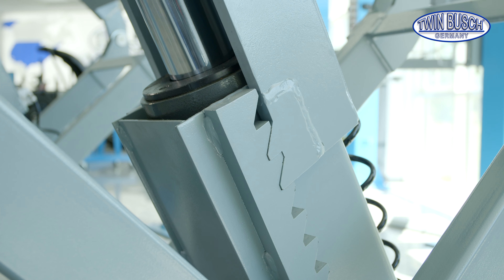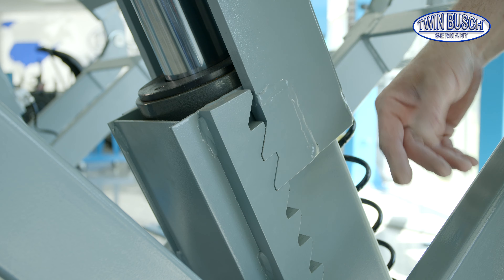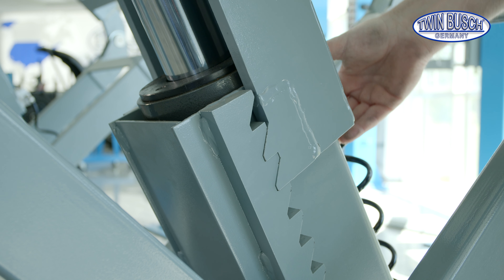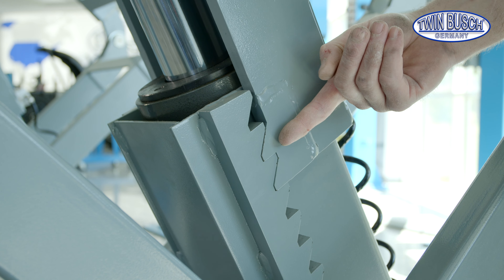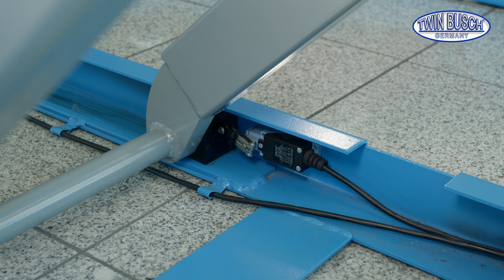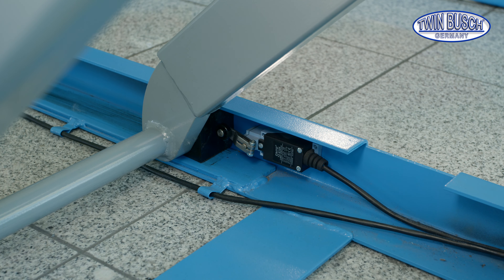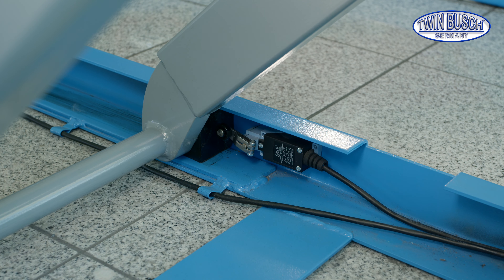The lift was driven up towards the shutdown point. Now press the lock button to block the lift. The lift lowers itself onto the safety catch. The limit switch on the base frame at the bottom must release again exactly in this position. If the limit switch was still activated, you wouldn't be able to lift up from the catch to unlock the lift. When Down 1 is pressed, the lift goes up, unlocks, and lowers itself.